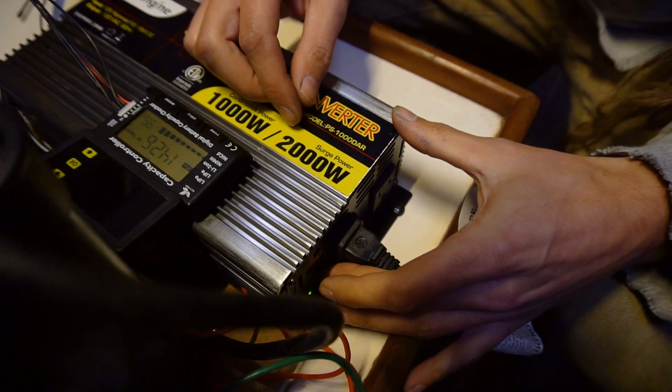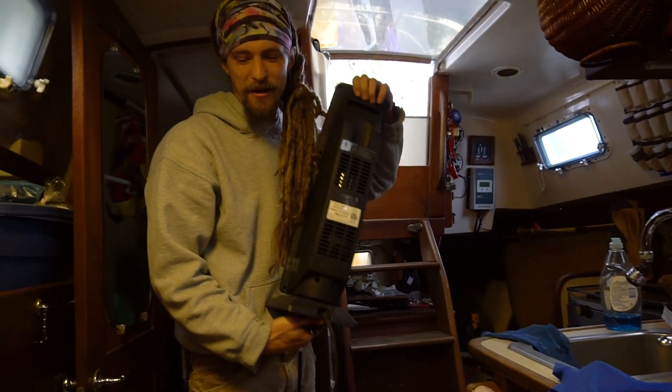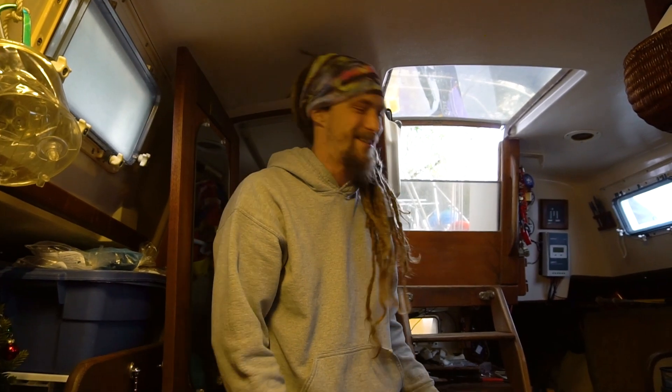The heater is too much of a draw — it's a 1500-watt heater and we only have a 1000-watt inverter, so it's not going to work well. We're now running a vacuum cleaner because it was the only load we could find that was fairly high, so we can discharge it closer to 1C. We're getting around 60 amps right now. I had to get rid of the other shunt because it wasn't working, so we'll have to send that back, but we'll get a test with at least the Hall effect sensor.